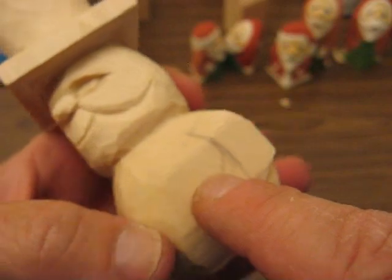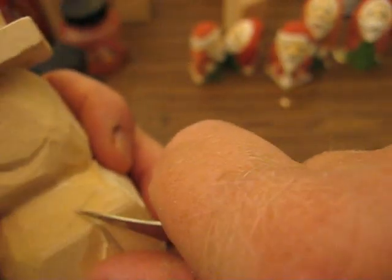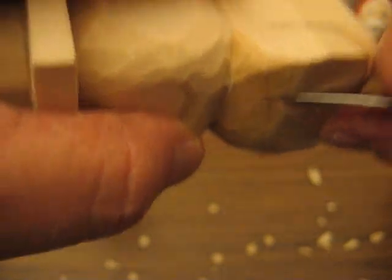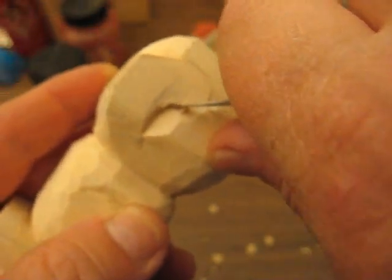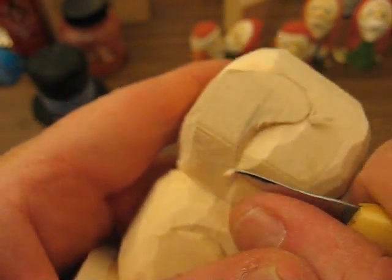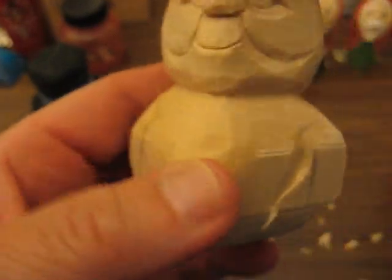Once you get those two portions done, go back up here where we did that stop cut and just follow that. Where the elbow is it's going to be deeper than where the glove is, so that's fine. Make a couple more stop cuts, turn that blade and get that corner out. Remember, you're going to go in straight with the corner, then when you turn it you're going to face it a little differently — you'll get the hang of it. We're just going to chop a little bit off here. See how that arm's coming? When we come back I'll show you how to finish up that arm and do the back end of it. We'll be right back.